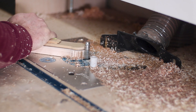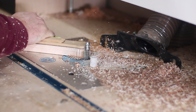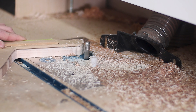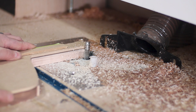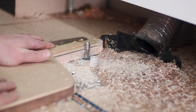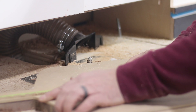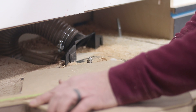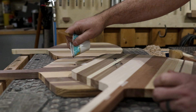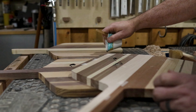That's three things — I got a little carried away with the two-sided tape. Because of the thin material I reinforced the template on the second go-around, and it made it through the whole process. As I went through it I was using less and less tape — down to one in each corner and two on the handle, six pieces total versus the excessive amount at the start. The back of the handle was the scariest part: a really tight radius, hard to support, and it's end grain — so please be careful. If you don't feel comfortable with operations like that, strongly consider a workaround.